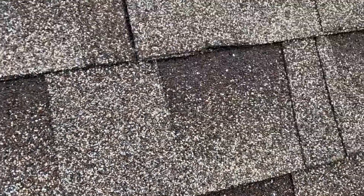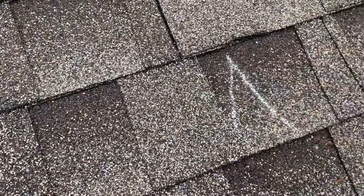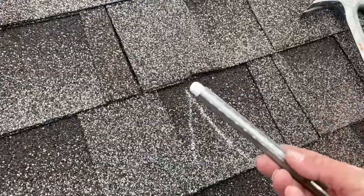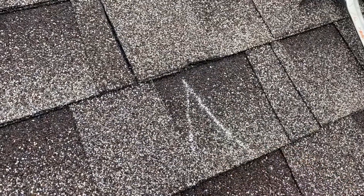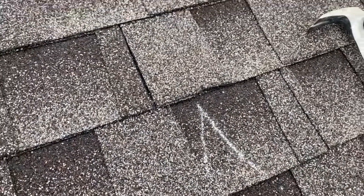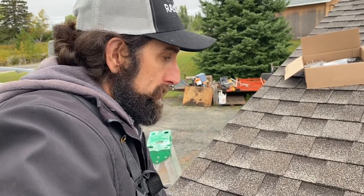So I know here that we have a truss, and as I move over it's hollow. I'm just going to make a V with the soapstone showing where it is — this doesn't damage the roof, it washes off after. It's just an easy way to mark the roof. Underneath the roof deck, which is typically made of plywood or OSB — 7/16ths or close to a half an inch — by tapping out I can find where that truss is.